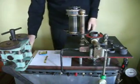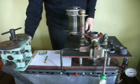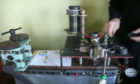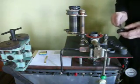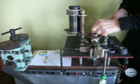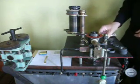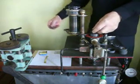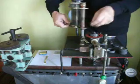Melting and casting in a vacuum protects the metal from oxidation. This way, rolling gold or silver can be cast and recast without damage to the integrity of the alloy. This can't be done with casting gold alloyed by so-called secret components. And when oxygen is present during the melting process, or when after melting in a vacuum gases like argon are forced into a casting flask to pressurize molten metal.